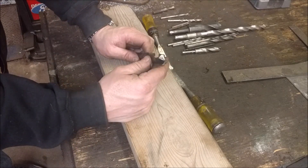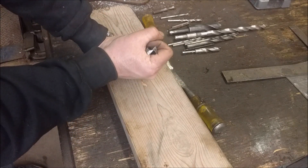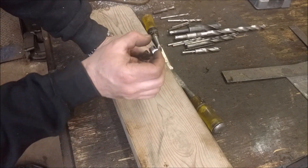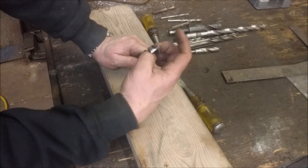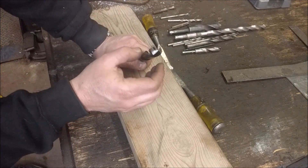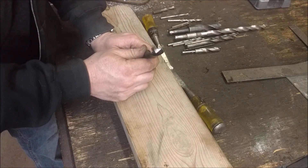When we look at the end of this larger three-quarter inch drill bit, you can get a better idea of everything going on. We basically have two cutting edges right here, one over there. There is a third one right in the middle, just a webbing that you have to have with the flute of the material. So you have three cutting edges, but really the third one doesn't do much at all. These two on the outside are your two main cutting edges that actually dig through the material.